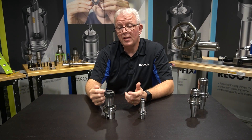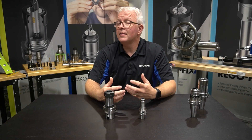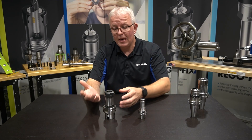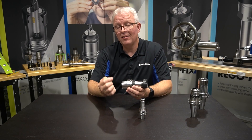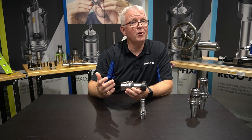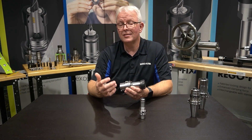The standards that govern the design for HSK tooling and for Capto tooling list adding an RFID pocket as an option. That's why you may pick up anybody's HSK tool holder, spin it around, and not see that RFID pocket machined into it. That doesn't mean your manufacturer made it wrong — the actual pocket itself is an optional part of that standard.